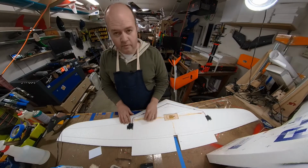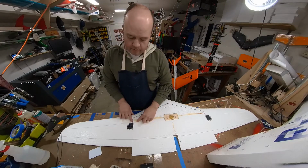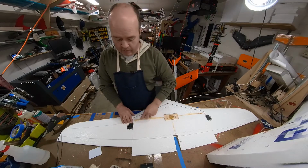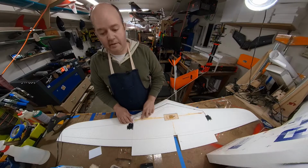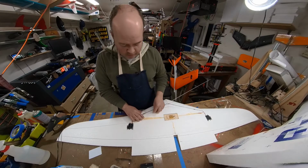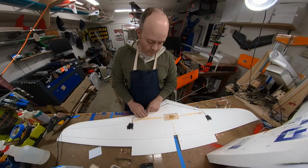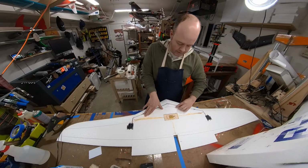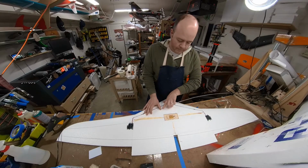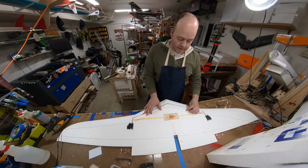One tip is when you get to possible problem areas, which are gonna be these sharp turns, stop your glue right before you get the turn and let that really cool down and set. That way when you bend it around that turn, it won't have any problems staying behind it. And then you may also want to just hold that for a little bit longer since you are having a lot of force on it. Especially with this bend here, you're gonna wanna do this section right here, do this turn, and then just hold that, make sure it cools down.